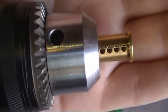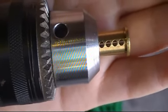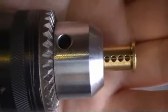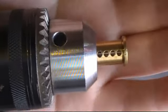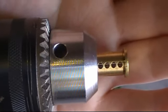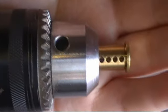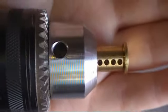I managed to get 4. You can see how I lined it up there so that the front face of the chuck itself is going to be one of my guides. And I'm going to have the file touching that edge so that I can't cut too far inwards, because I'll interrupt the other pinhole.